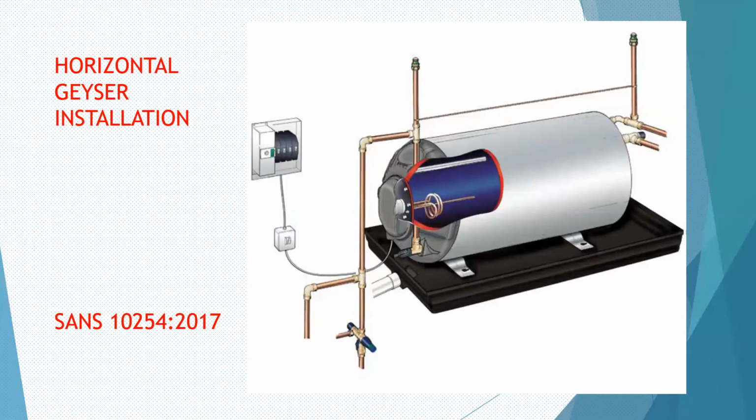Now you want to find out, without going into the roof, what type of valve is going to be in the roof, because you see here, and there's no doubt about it, that this is unbalanced, and there is a pressure control valve installed at the geyser. And you can, from this now, deduce there's going to be a problem. So you close the handle, go to the left-hand side, open it up, and guess what happens? Your pressure reading on your gauge stops at 340 kPa, 340. So what do you know about the system? You know that there's a 400 kPa pressure control valve at the geyser. You know now that the pressure on the cold lines, even inside the house, is higher than the hot water pressure from the geyser. So it's unbalanced.